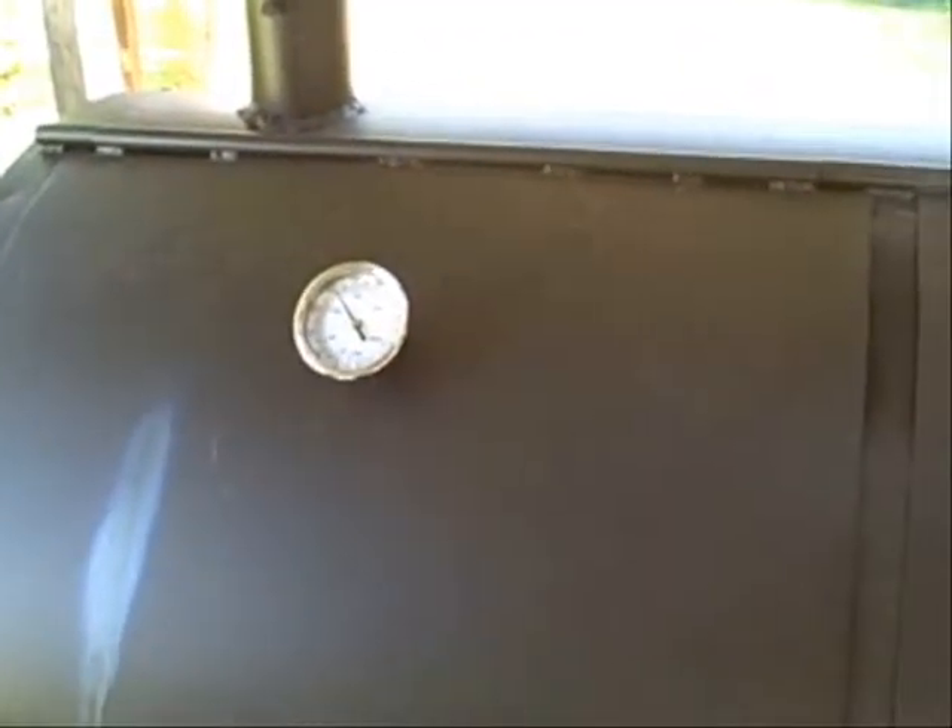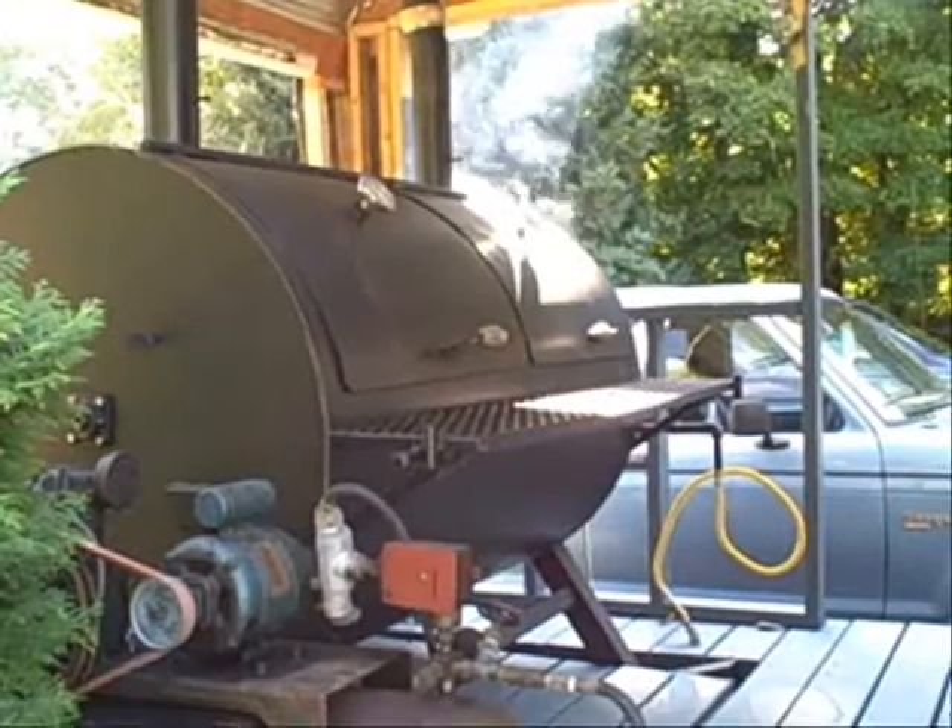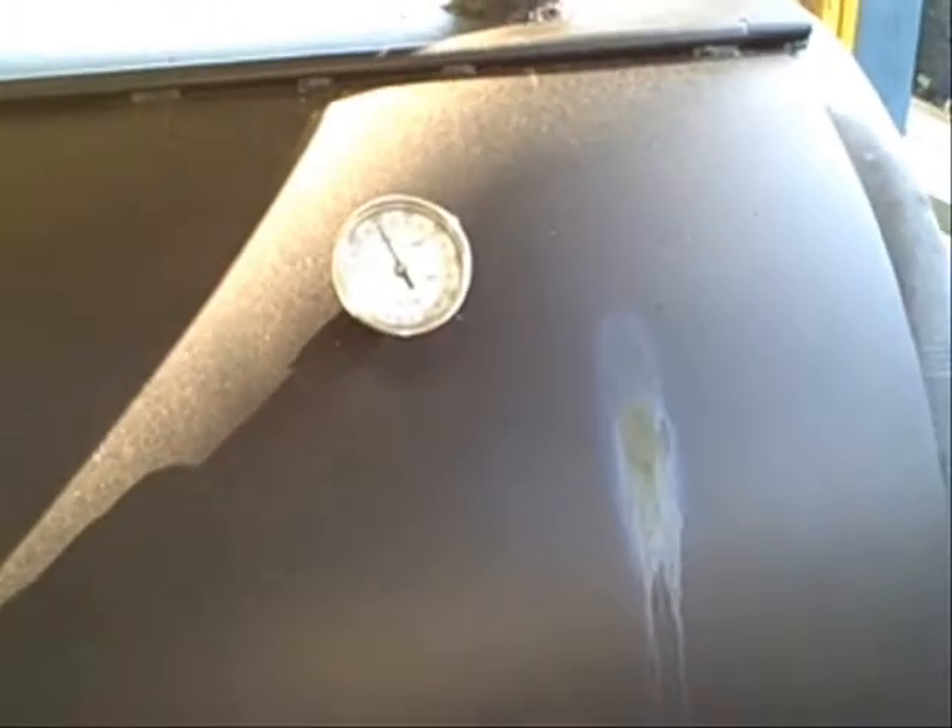From that change in air I'm beginning to see a settling of temperatures. We're 20 minutes into the test and we've basically got a 25-degree temperature variance, and like I said there is no baffle between these two, so that's just from differences in radiant heat. Now I'm going to swap it — close this side and open the other — and see what happens. After about 10 minutes the reverse holds true. I haven't changed the main damper at all, just reversed it, and we've got 325 and climbing on this side and just under 300 on the other. So that's without a baffle. I think this test is pretty conclusive — the couplings are working quite well. I'm very happy with this.